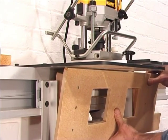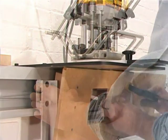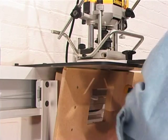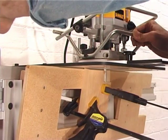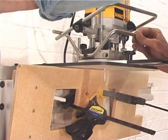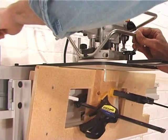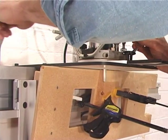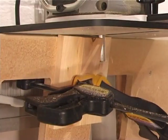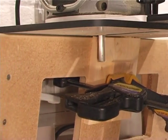By the way, the raised and fielded panel can be made on the mortise rail too. Note the size of the thing that can be worked on below the plate and how carefully you can hold it. Use a 1/2-inch panel cutter bit and clamp in the panel and cut on the down cut to get a clean shoulder to the panel. And back on the up cut to get a fine finish to the face of the fielding. And if you've polished up the cutting edge, it should cut as clean as a whistle.